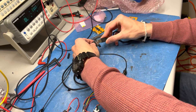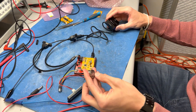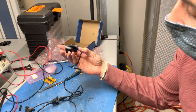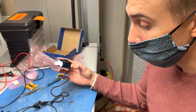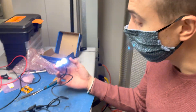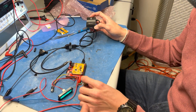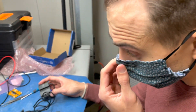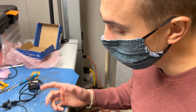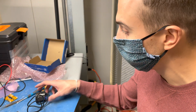Let's test that load. I'm going to connect this in. Right now this is not going to turn on because the switch is not pressed. As soon as I press it, that'll allow me to engage this — and you can see that green LED turn on. Boom, there you go. It's a lot of power coming out of those 5-volt USBs. Each port can output 2 amps. It can power a lot of your LED applications — lighting, illuminating the road, providing safety for you. So this is not only a solid-state digital switch, but it's also a 5-volt buck converter, which can charge your phone, power your LED lights. You get a lot of bang for your buck — a big load that can handle your motor, and also USB for accessories like charging your phone or running LED strips.